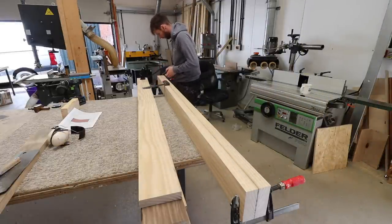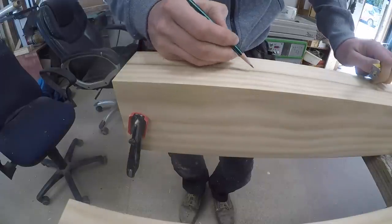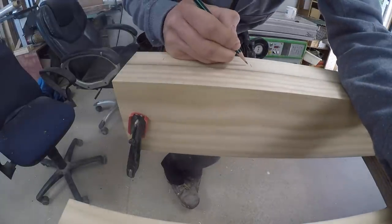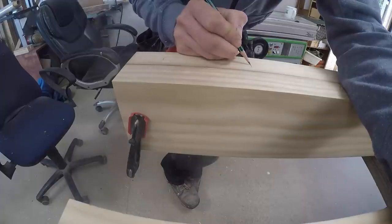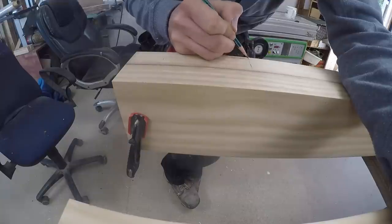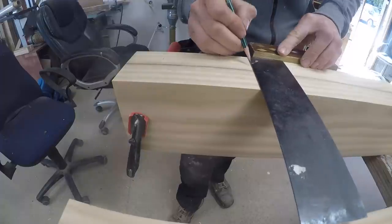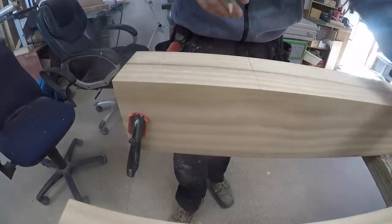Top rail of the door, we don't need to do a setback. You can if you'd like to, as there is a small risk with any timber when you're mortising that the mortise chisel could chip or not do an absolutely perfect cut on this inside line. So you could do a tiny setback if you wanted to be absolutely certain of having a dead crisp edge along the inside there. I've never bothered with that. I've always managed to get on quite well without doing that.